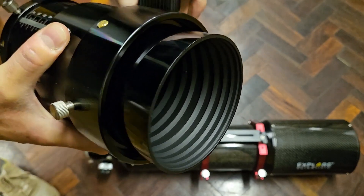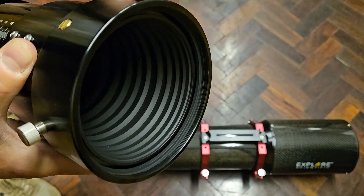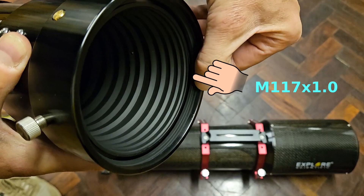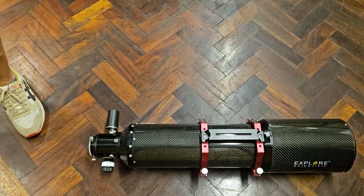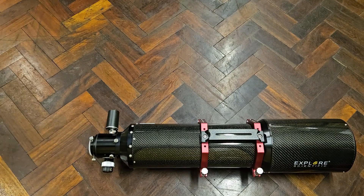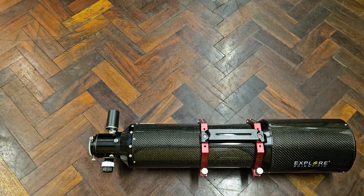The connection end, which we need to make an adapter for, has a 117 millimeter diameter thread at one millimeter pitch. That thread is eight millimeters deep, so we need to make an adapter that will allow us to connect the focuser to the breech end of the telescope tube.